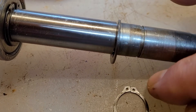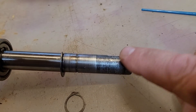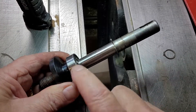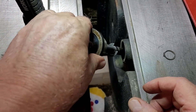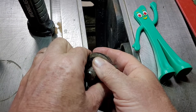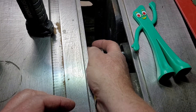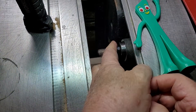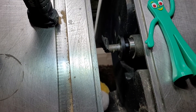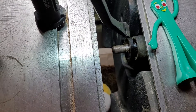We've squashed that clip so that those two ends are right next to one another, and when we slide this in — I'll show you what that looks like when we put it all together. This end has the pulley on it that goes down to the motor, but we'll see that in just a second. So now we're going to push this shaft back in. I've already oiled this bearing up, even though it's supposed to be a sealed bearing, but it's one of the original bearings that was in this table saw long, long ago. Let's see if we can get that in there without dropping it — that goes in there and through the other bearing. We'll need to push that in. See that bearing sticking out, it needs to go in. So let me get something to do that. I've got a big pry bar here — let's see if this will do it. There we go — good. So that's all the way in there now.